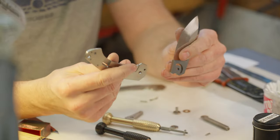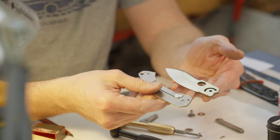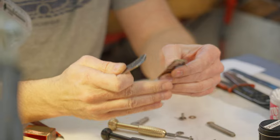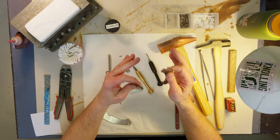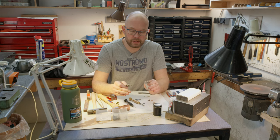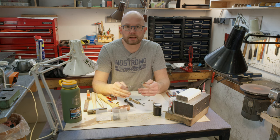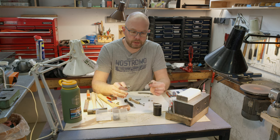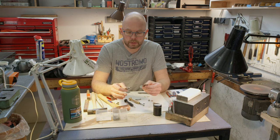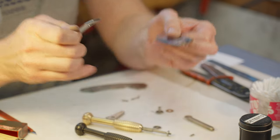The next step — this being a new model — I will scribe a line on the blade from the front of the lock and then set my fixtures to meet that line perfectly. There will be a lot of walking back and forth testing the fit of the lock. When I'm 100% satisfied with the adjustment, I'll mark those numbers down and then repeat that same geometry for the lock on all the rest of these Zeros. Next step is doing an assembly of all the parts and scribing a line on the blade.